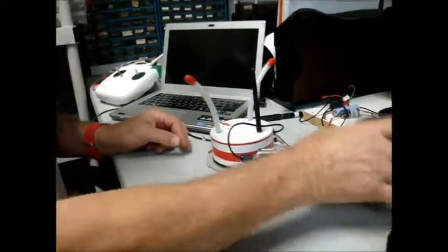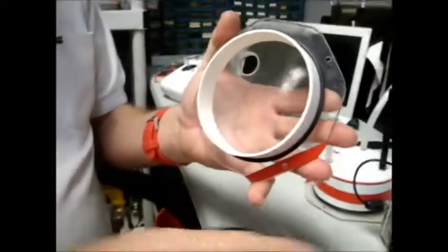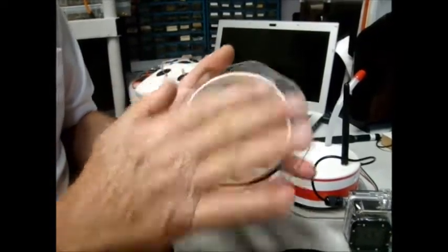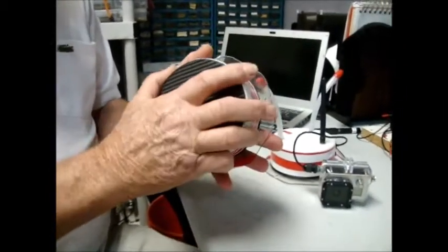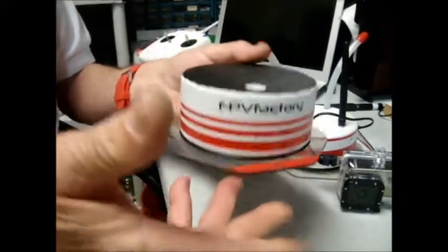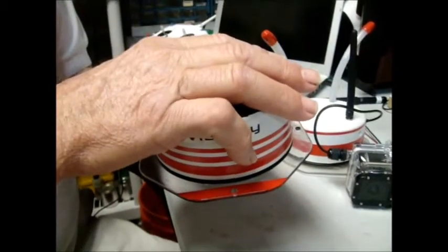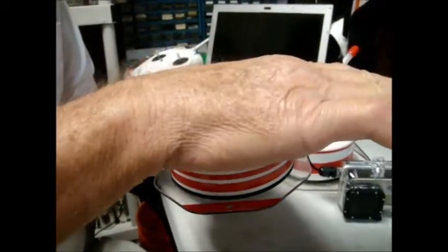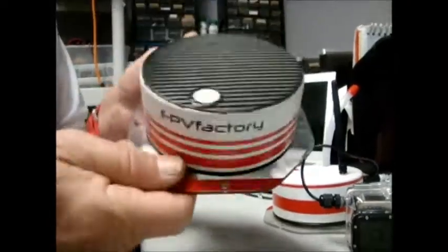What feeds up through the top of the bracket is a cable providing audio-video to what I call the 'top hat.' I've taken the acrylic plate and added extra room on top. We have an o-ring seal around the margin, a tight-fitting ceiling plate, and a very lightweight polycarbonate lid. The lid flips down and compresses onto the o-ring — if a wave hits it, it compresses the seal further, making it highly waterproof. This also gives us more volume for electronic equipment and raises antennas higher to avoid interference with waves near the ocean surface.